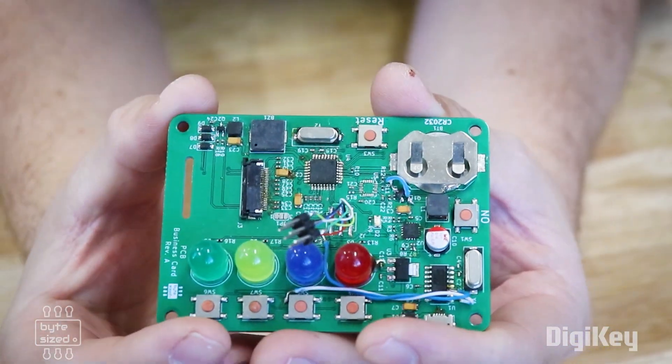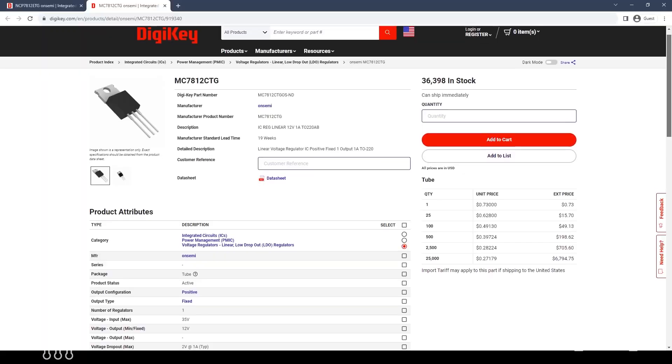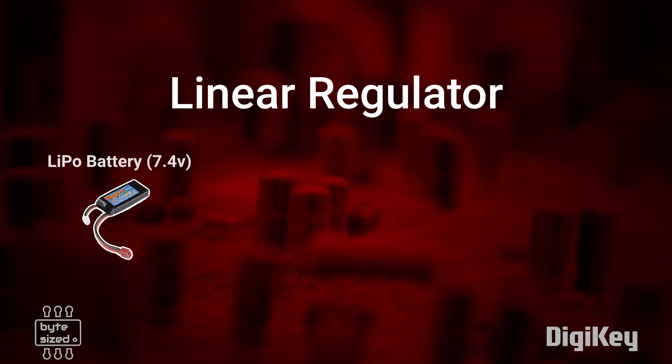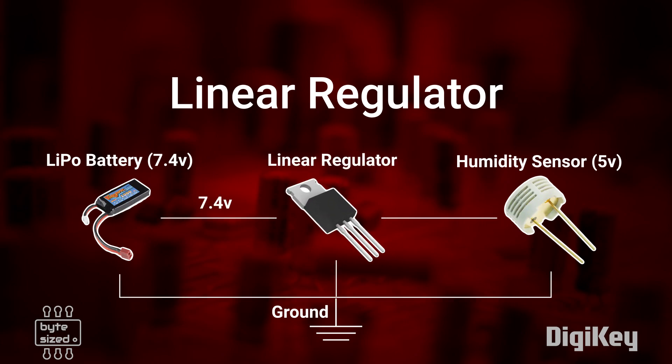Sometimes you might be working with components on a PCB. Circuit board components often need power supplies with tighter tolerances. A common type of PCB power supply is the linear regulator. These ICs are very easy to use and often just have three pins: ground, voltage in, and voltage out. For example, if you have a two cell lithium polymer battery with a voltage of 7.4 volts but your humidity sensor needs 5 volts, you connect the 7.4 volt battery to ground and the input and you'll get 5 volts at the output. The big downside is that linear voltage regulators are very inefficient — the extra unused voltage passes through the internal resistance of the regulator, generating heat instead of powering something useful. This problem gets worse when the amount of voltage drop increases.